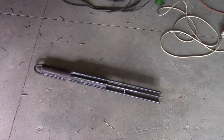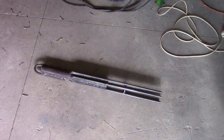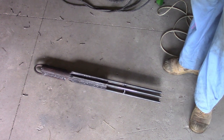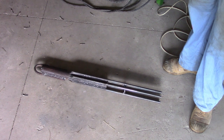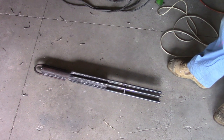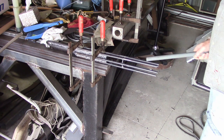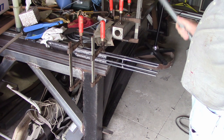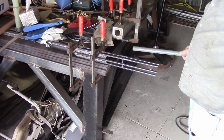There's the finished product. I've gone through and run the wire brush over it, got all the welding slag off, and now I have to decide whether I'm going to paint it or galvanise it. I think I'm inclined to get it galvanised - I'll ring up and find out how long it takes and how much it costs and go from there. Now that I've got it all welded up, the next thing to do before I paint is to bend these out into shape. I'm bending them before I paint because the stress of bending after the paint's dried will crack the paint.